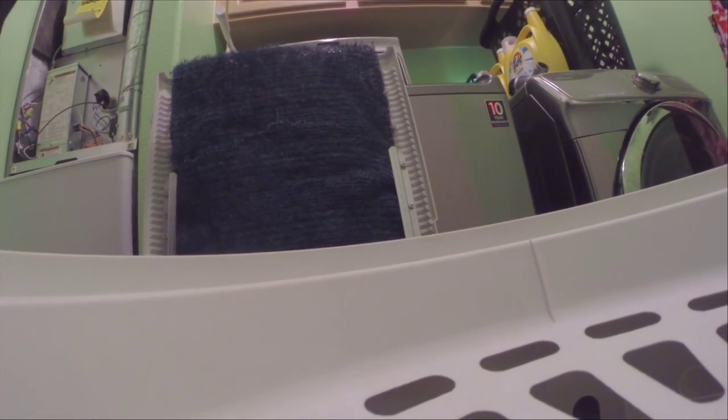So we've got the hogs hair filter all clean and ready to put back together. We just need to make sure the back side goes to the back, and put it into the filter grid — just tucking it in, pressing it in on the first side, then folding it in half from the center to work it in for the second side. Now we're ready for the install.